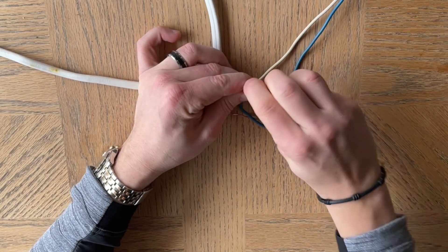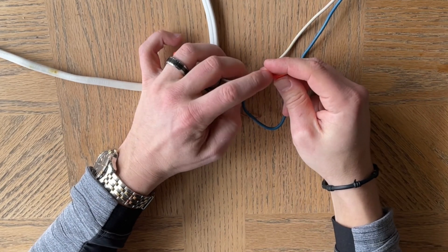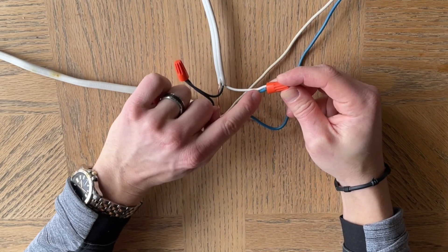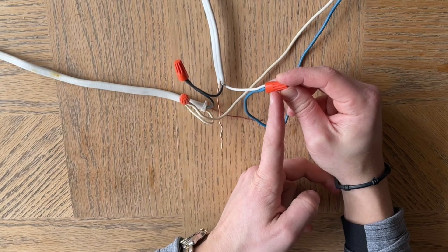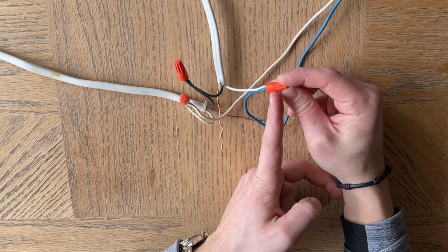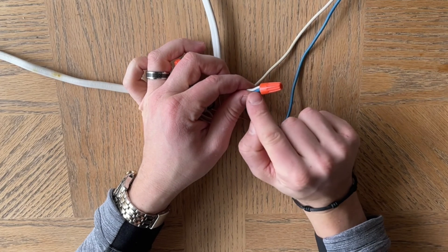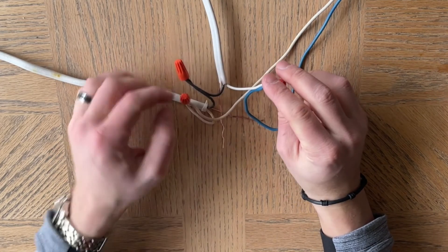See there, that's a little better. I'd still make sure that it would be further up in there. Generally you want the insulation to be up in the wire nut to the smooth part of the nut. That way you're sure that nothing will ever touch that live wire.